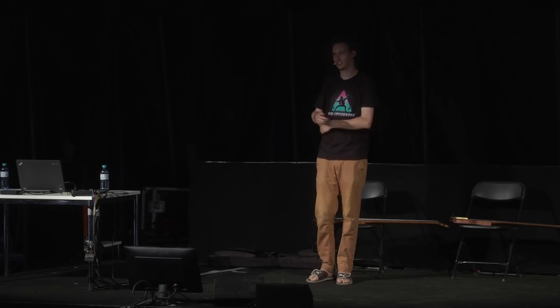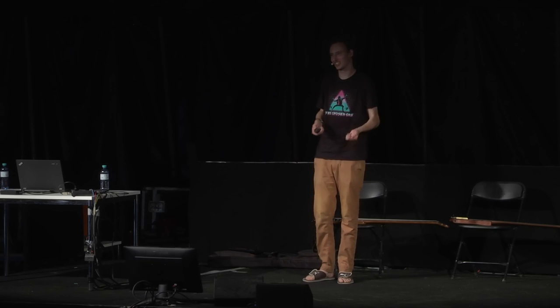And they look quite nice. It's a nice optic. And if you want to really have a strong neck, you can always do veneer lamination and make the pieces of wood you join together like 0.6 millimeter thick. And yeah, then you basically eliminate all the effects of grain structure in the wood.